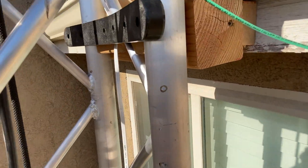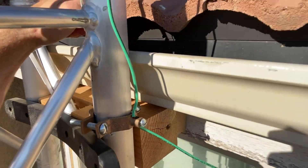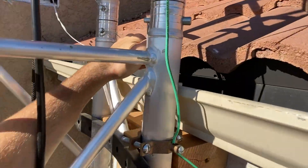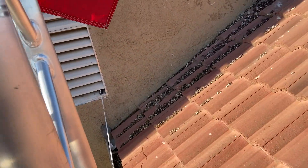Right up here I've secured it to the siding of my house — this is what keeps it stiff. You can see we've got copper grounding and a ground wire that goes all the way down. And up here I have a lightning arrester on the antenna, which is then grounded to the mast.